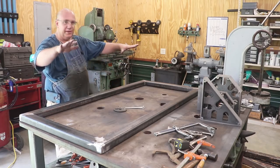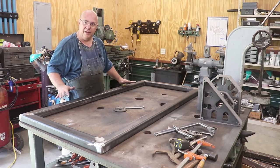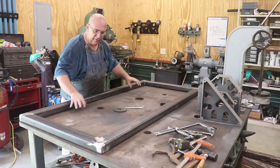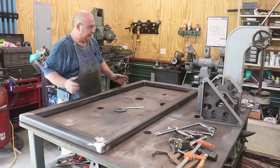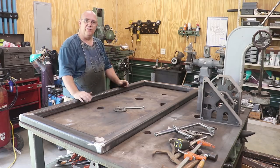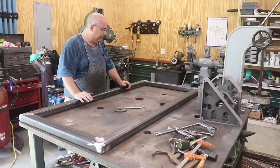Again, this is where the surface plate is going to sit on. Now I am going to come in here a little bit, or later in the project rather, and we'll build some extensions in here. There's three points of contact, and that's going to actually sit in here. But the next step is I want to get the legs on this, four legs coming off of it, do some bracing, cross bracing in that. And that's going to be in my next video.